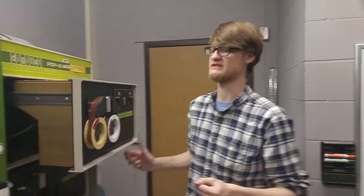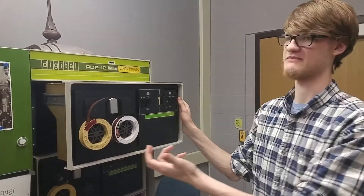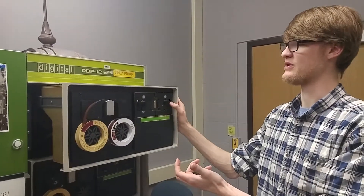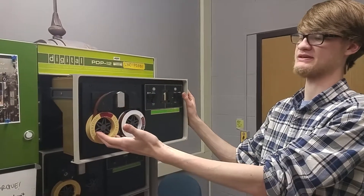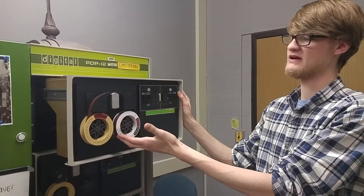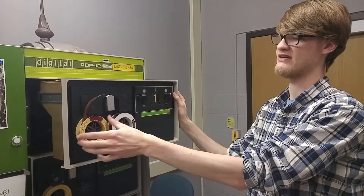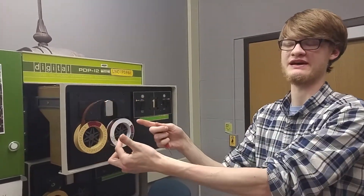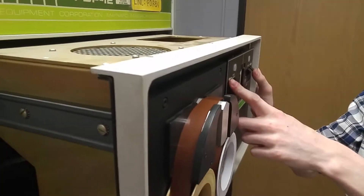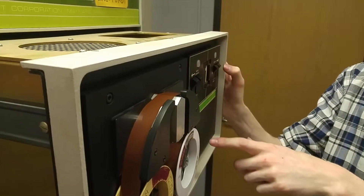I have been playing with the torque on the hubs for the tape drive. For each hub, there are two different adjustable torque settings. When you are moving in one direction, this hub is moving at full speed, and then this hub has a slight back torque on it to keep tension on the tape. You can adjust that torque so that you keep that tape flush on the head. As I have it now, you can't see that it's moving even — unless it bounces. There's a little bounce.